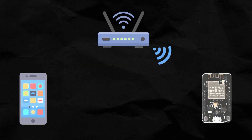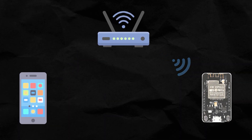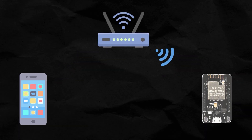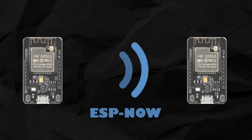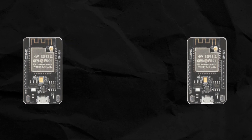The reason the first car was so slow is because any command I sent went from my phone, through my router, and then to the car — that time span is where we were getting delays. This time we're going to be using something called ESP-NOW, which allows two ESP boards to communicate directly with each other, removing the need for a router and making things a lot quicker.